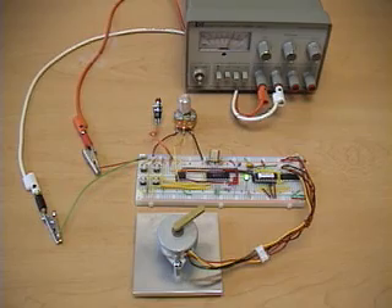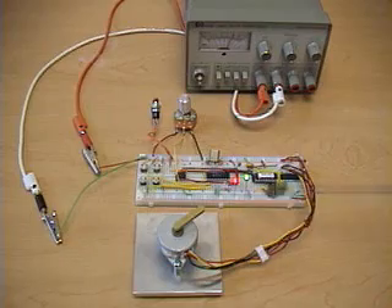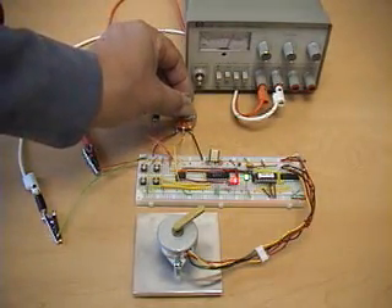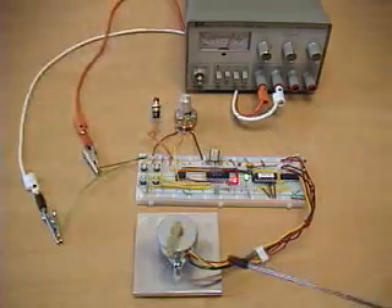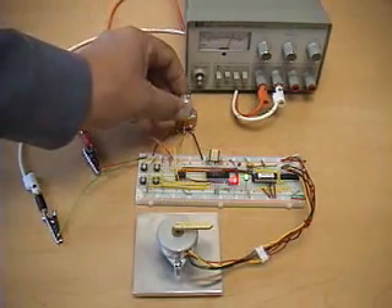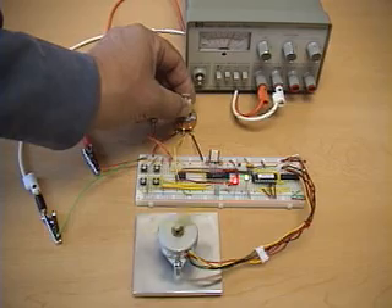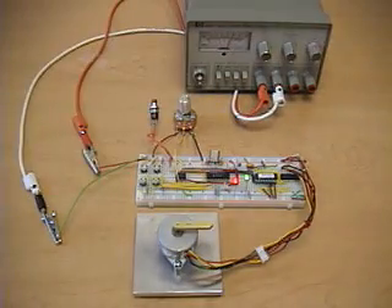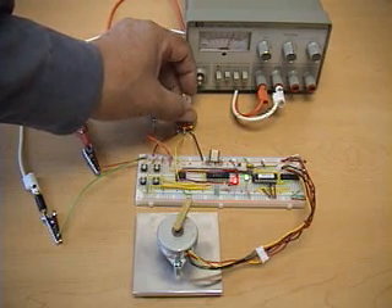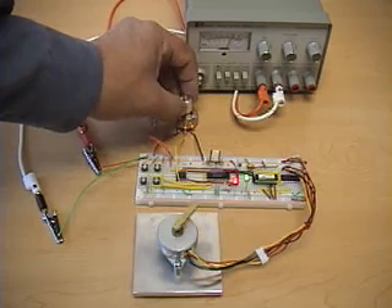Now to enter speed control mode, we press the other button. The red LED appears indicating that we're in speed control mode, and the potentiometer becomes active. If you turn it to the right a small amount, it turns the motor clockwise, and as we turn it further it increases the speed of the motor by decreasing the pause between each step. We can also turn the potentiometer counterclockwise to have the motor turn in the other direction — the speed is proportional to the potentiometer displacement.